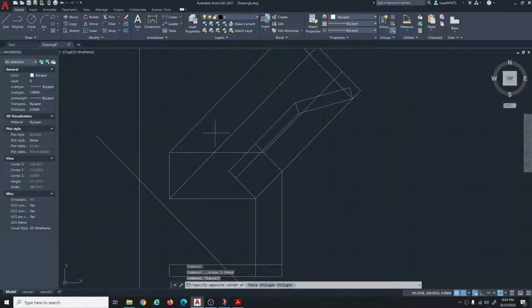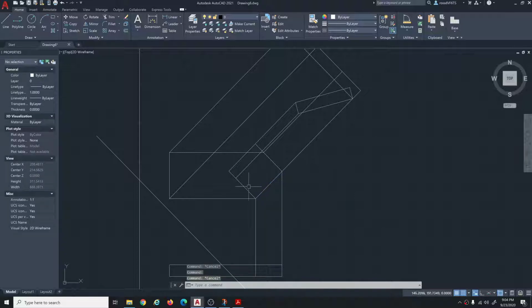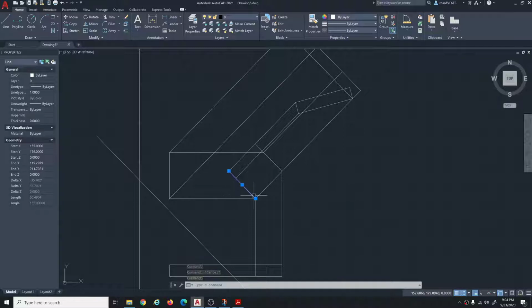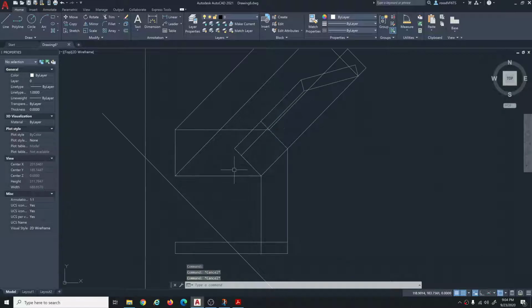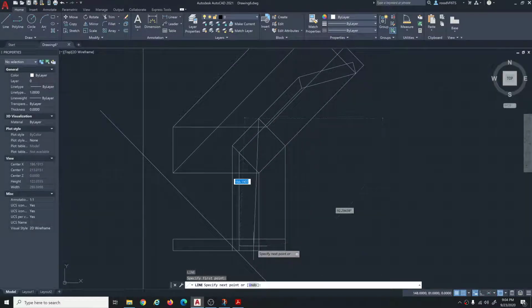Okay, so this right here is what the flange looks like in the top view. This dimension is true, it's 50, but this dimension is not. It's not in the plane of the paper, so it's some weird length. It only has the true length back in this other view. Now I can continue like this, and I can project down from this to determine what the flange looks like in the front view.